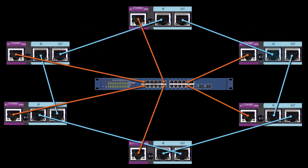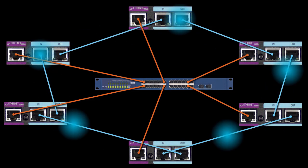By definition, Bluelink audio stays off the Ethernet network, and that's a key differentiating advantage of Bluelink. AVB, CobraNet, and Dante are supported by Harman because sometimes it's nice to send audio through network switches, but those switches often require careful programming to ensure that audio traffic doesn't corrupt or become corrupted by other network traffic. Bluelink allows you to avoid these potential problems entirely by offloading bandwidth-hungry networked audio onto dedicated cables, increasing system reliability while decreasing network strain, switch port usage, operational costs, and material costs. Bluelink is essentially Harman's cheat code for networked audio.